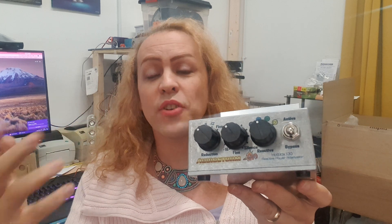The blue mode is obviously a bit warmer than the resistive, like you'd expect, but it still retains a lot of upper high-end clarity. It allows a lot of the brightness through — it acts as if there was a lighter voice coil, a smaller magnet, and less windings, so it's very responsive and bright relative to the other modes. The green mode is nicely in the middle — a balance. It's like having a slightly heavier magnet, slightly heavier core, slightly more winding. It's a little bit warmer sounding, feels a bit more dynamic, a bit more compressed — like a certain traditional green thing that we all like.